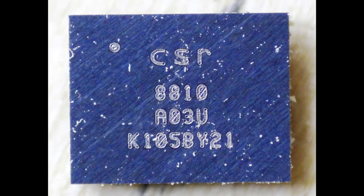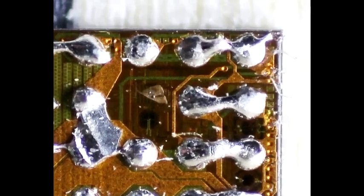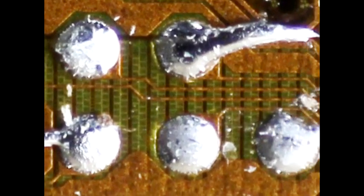Another really interesting part is the Bluetooth chip. What we're looking at on the back is a silicon die with no packaging at all. They put the balls directly on the wafer and solder it directly to the circuit board — no packaging. Sometimes they'll underfill them to prevent moisture from creeping into the balls. More importantly, for achieving really good signal integrity on super high frequency signals — which Bluetooth certainly qualifies as — this approach is really good because there are very short pathways between the component and the circuit board.